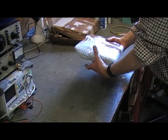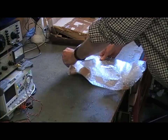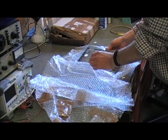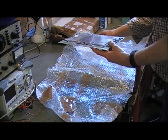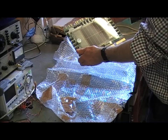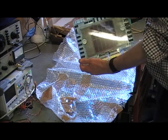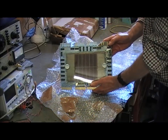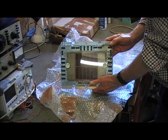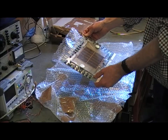Here we are: 8K word, 12 bits a word, core store. That's 8,192 locations and by 12 that's over 98,000 cores. They're very small ferrite magnetic cores — less than half a millimeter, or 20 thou if you're thinking in Imperial.